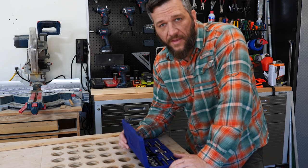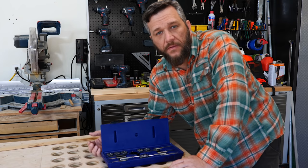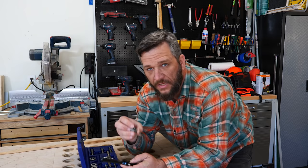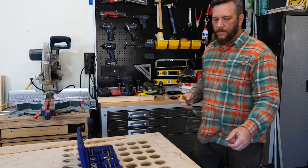By now you may have figured out how this is all going to work. We're going to turn dowels with a tap and die set — specifically the die set — because as my good friend Worf would say, "Today is a good day to die." Take your die wrench, and I'm going to be using the half-inch die. Obviously, that's why I cut everything at a half inch. These just have a little set screw.